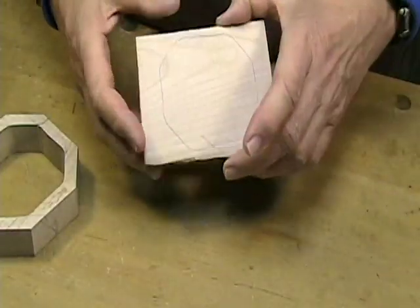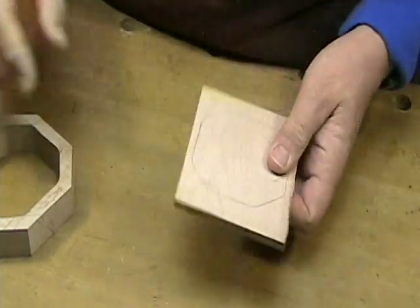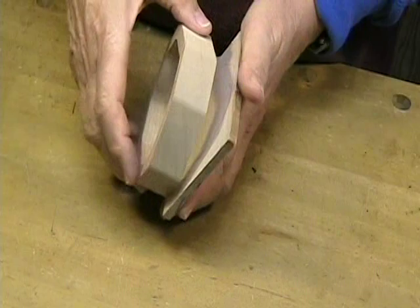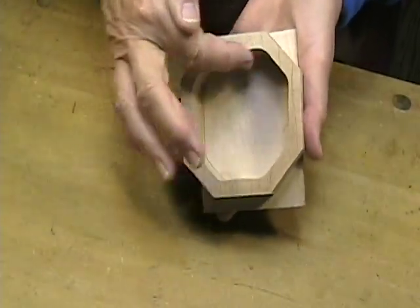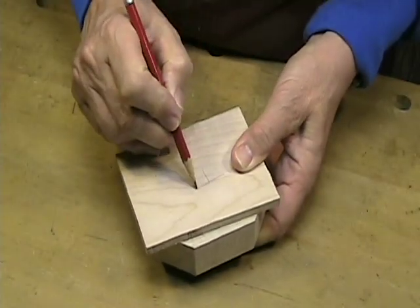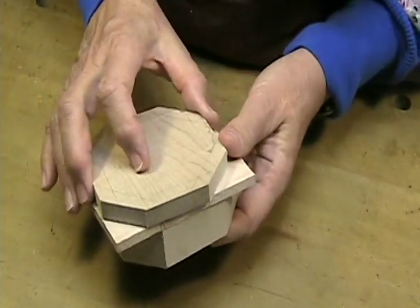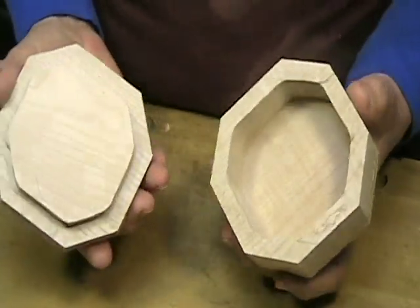I'm also going to take this piece of wood, which I've cut from a very similar piece of maple, and I'm going to take the other end of the box, the part that is going to be on the top, and flip it over. Again, I'm going to match up the registration mark with the mark I've put inside there. Once I've done that, I can trace around the inside of that, so that when I glue this part, and I can put a TOP on here because that's going to remind me that that's what goes underneath the top. It gets glued in place. If I have all of the registration marks lined up, when I'm done, everything should fit really, really snugly and beautifully. All right, I've taken my clamps off